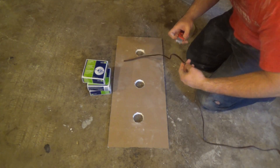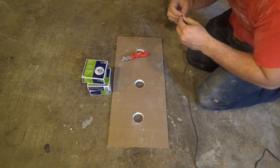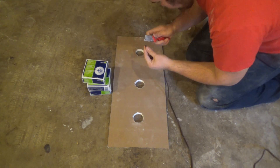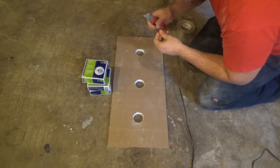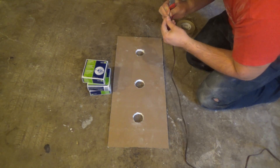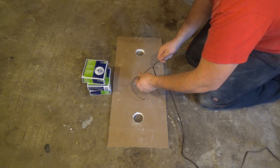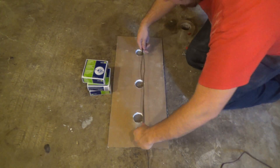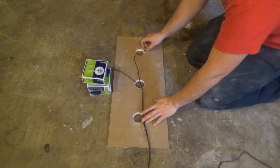Then you just want to go with your knife and actually split these two cables apart. You can just kind of start it up at the top. You don't want to cut the wires themselves — you just want to cut through the plastic. Once you've started that, you can just peel them apart down to that spot. Now you've got your two wires; you want to keep one on one side and one on the other.